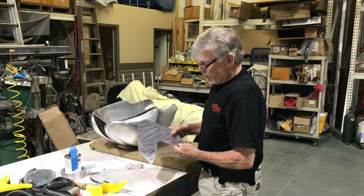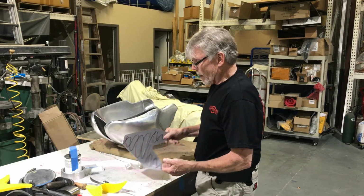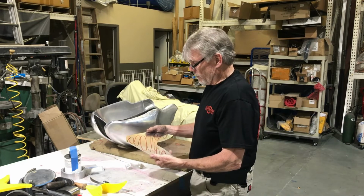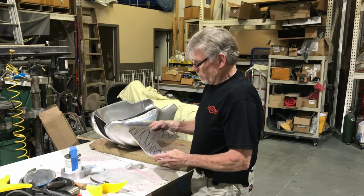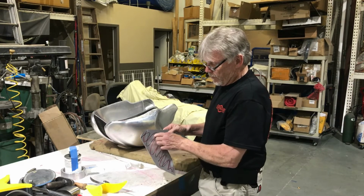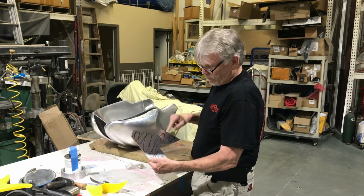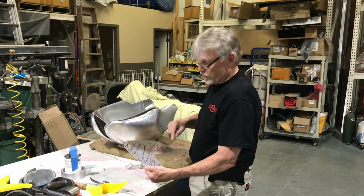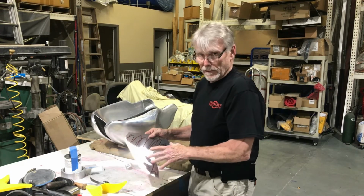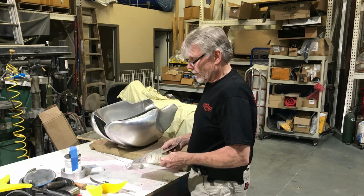So there's the aluminum piece. We're getting ready to anneal this, and we use a special little trick that I found a while back. A lot of guys will heat it up and put soot on it with an acetylene torch, and that's messy. It gets the shop all dirty and sooty, and you blow your nose and you blow out black boogers. This is a really nice way of doing it. You use a Sharpie pen. Red goes away at about 700 degrees and the black goes away at about 900 degrees. So the red is just so you can make sure that you're evenly heating it all the way around with your torch. And then as the red disappears, you know the black starts to go, and it gives you an indication of exactly what temperature you're looking at, so you don't burn the metal. So that's our little lesson today.